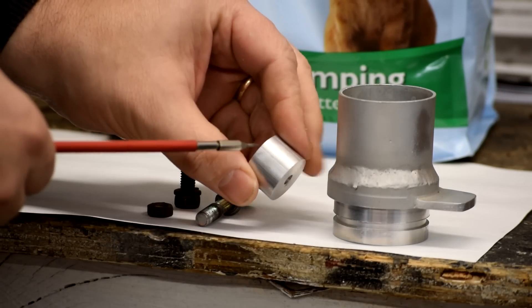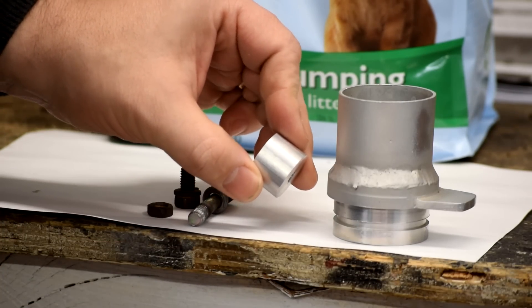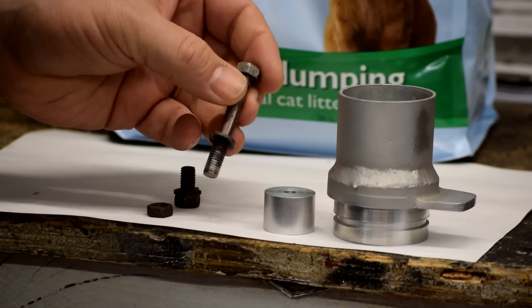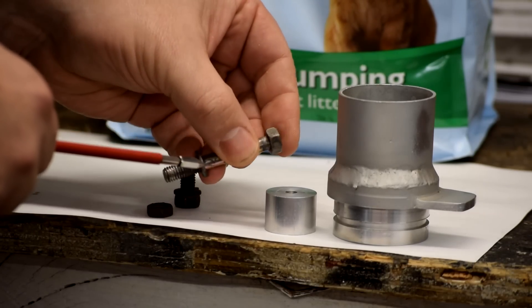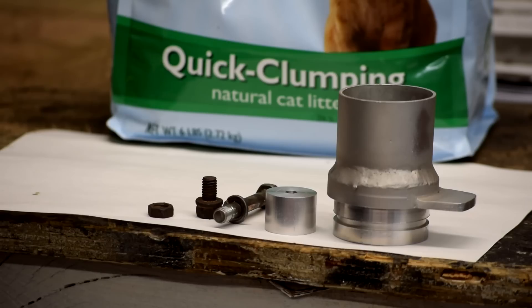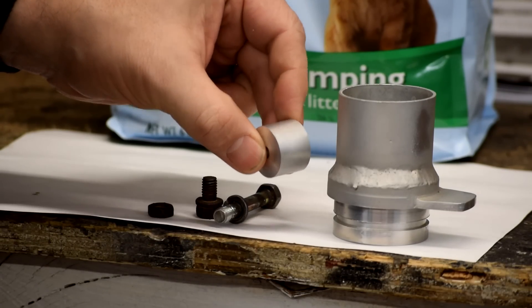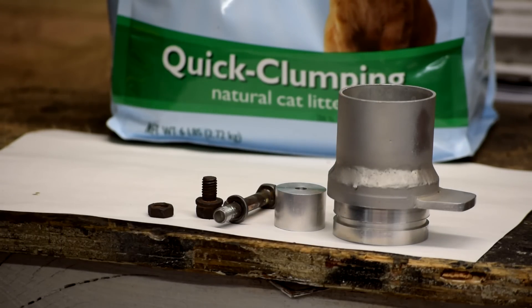The aluminum extrusion — the side here is nice and shiny, not polished but shiny. That's not much different than one hour run time, so it's only useful up to about one hour. The cadmium plated bolt with some rust on it did take off some of the rust, but there's still quite a bit there and it didn't touch the CAD plating itself — not very useful. The rusty bolt and rusted nut, it didn't touch at all. As far as the crushed walnuts and this vibratory polisher are concerned, pretty much a bust. I can take 10 seconds with the buffing polisher and do a better job. This kitty litter stuff — it's a no-go.